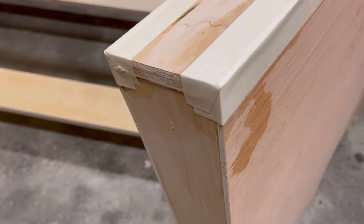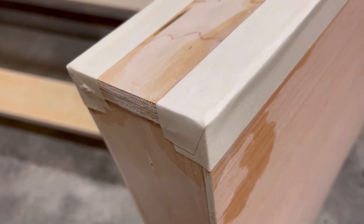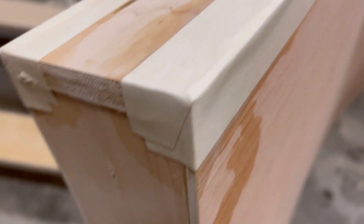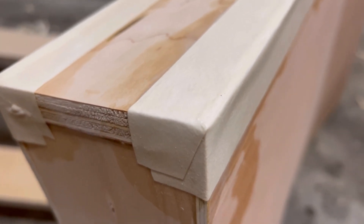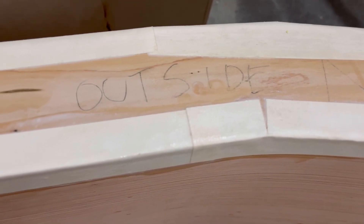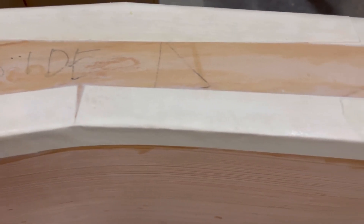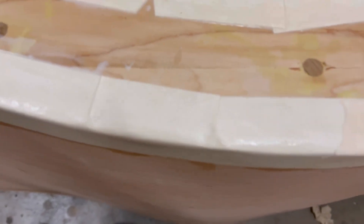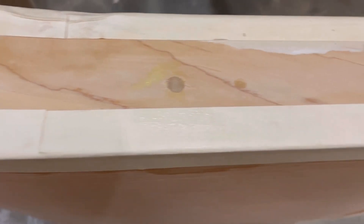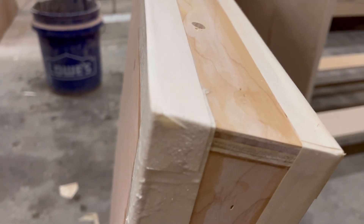Here are the results. I use a lot of the same techniques you would use with glass cloth, but I'm using paper seam tape. You can see here where I snipped the corner and then folded them over. And then where it starts to curve, you've got to snip it — here I snipped it so it's curving the other way. Another snip, and there is the folded corner.